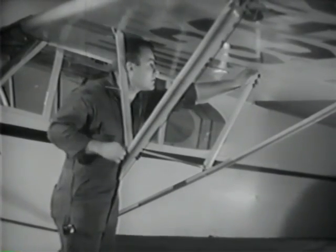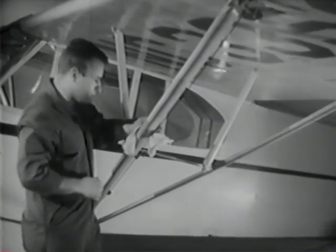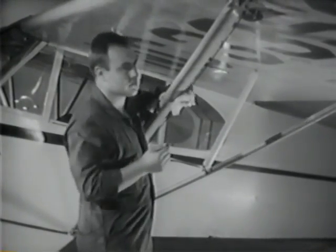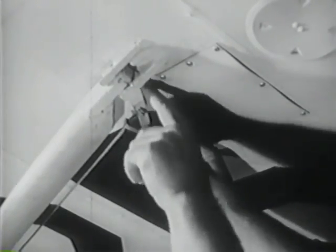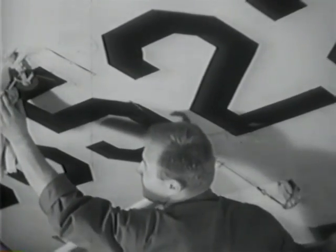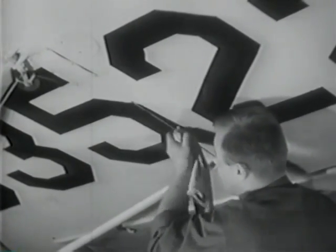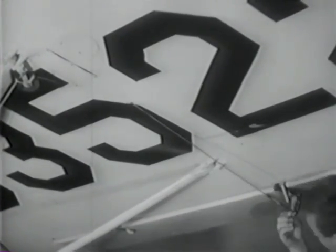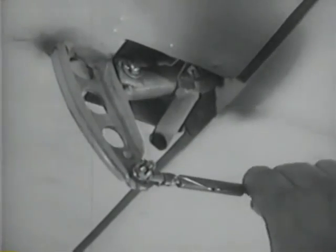Check all the safeties. See that the pitot tube is clean. And as you go along, continue checking the aileron cable. Inspect the bolts and fittings at the aileron control pulley. The cables should show no signs of chafing or corrosion, and there should be no broken strands. A rag will catch on them and show you if there are any. Be just as careful at every other point in the aileron assembly — at the horn, turnbuckle, and hinges.